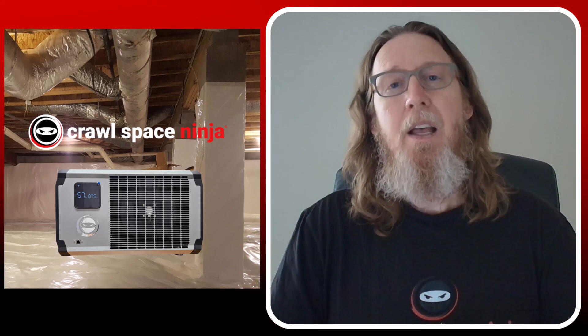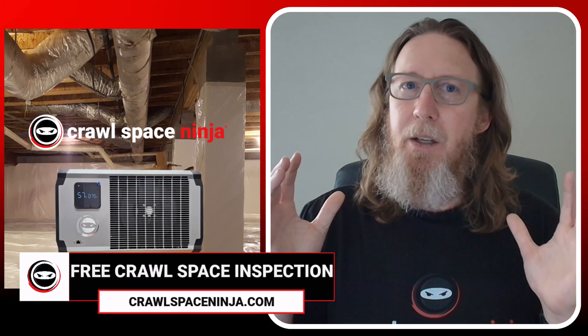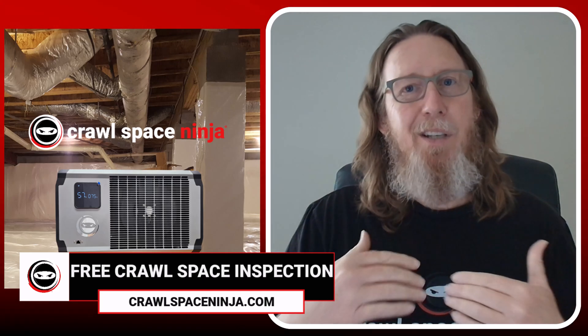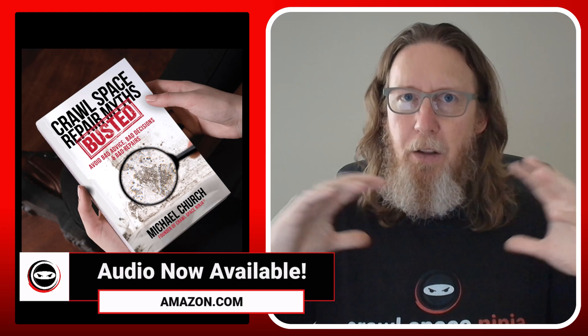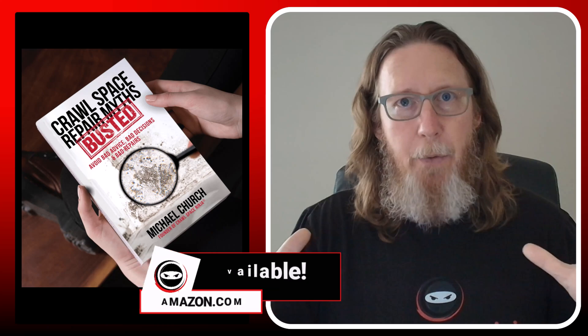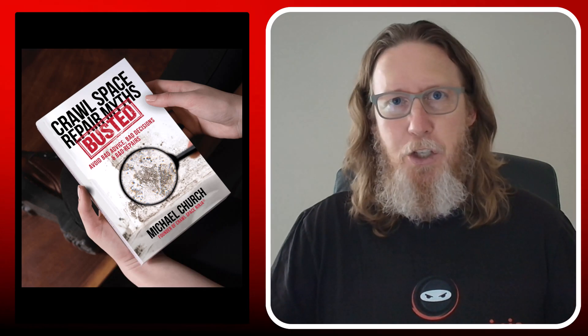What you have to do, Brennan, is seal all the vents of the crawl space and install a dehumidifier. In Louisiana, that is what I would recommend — probably all parts of Louisiana. I don't know exactly what kind of foundation construction you have, whether brick, block, or concrete. Some parts of Louisiana even have an open crawl space on pier and beam. But if you can make sure you have a foundation wall, seal those vents, put in a dehumidifier, and make sure you have a good vapor barrier down — that is what I would recommend to control humidity. Forget about the ventilation aspect of it.